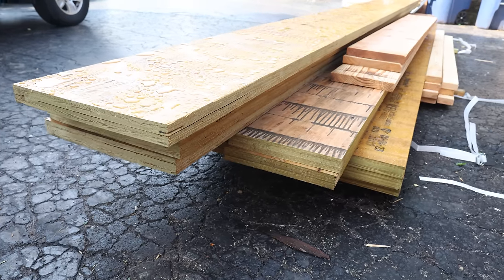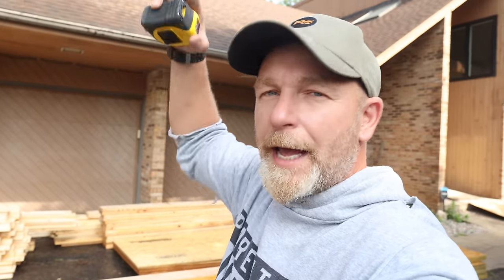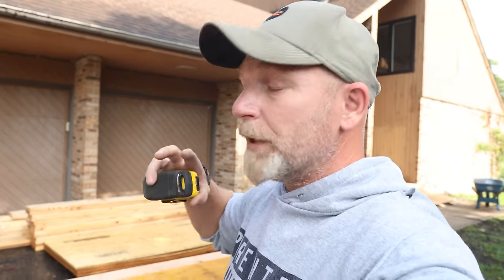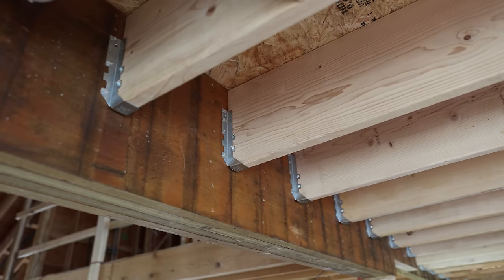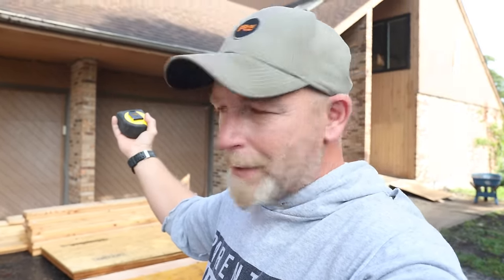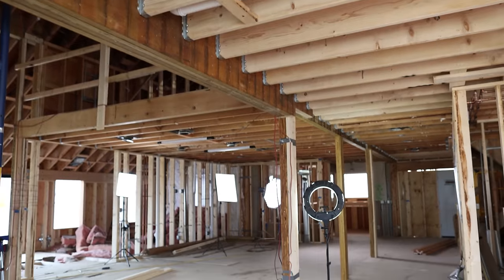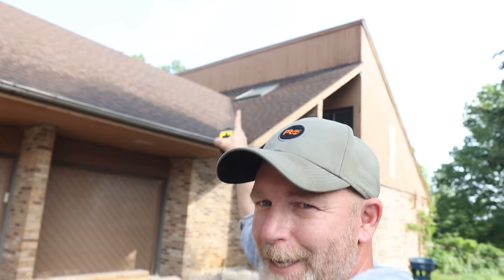These are the micro lams we're going to be putting into our ceiling. Each one is an inch and three-quarters, and we're doubling them up, which means they're going to be three and a half inches wide. These beams are 18 inches high, and there are a couple of sections where we actually have to triple them up. We have a very long span where we put three of them together, and that's where you really need to contact an architect or structural engineer to make sure the load for your house is correct. We're going to have a few inches sticking down and we'll wrap them, but we're stuck with the 18-inch size because our entire roof line sits on these — it holds pretty much the whole second floor plus the roof line.